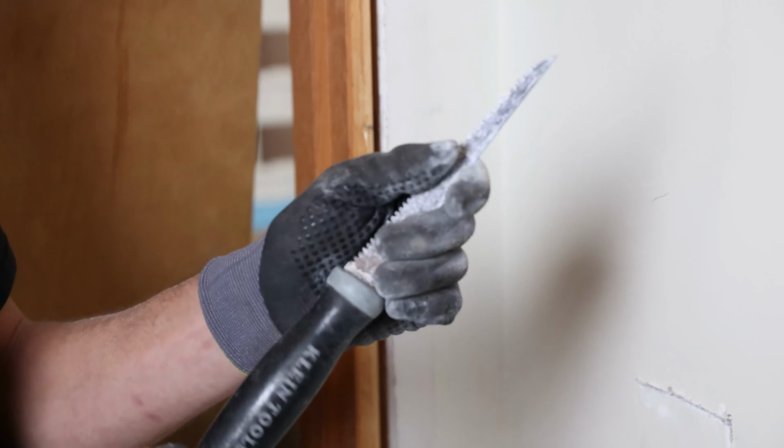I'm gonna label all these wires. I've got 4 of them. 3 of them are identical before I fish them down the wall. And I'm not quite ready to do that, but this is vanity lights. V-A-N, vanity. This one is hot. H-O-T, feeding from one box to the next, carrying my main hot, my main neutral. That's like the trunk line. And then this one, I'm just checking each one of them. Be methodical. I'm not good at methodical, but I need to be. This one is wafer. So when I fish them down the wall, I know exactly what they are. Keeping the labels, labeling the heck out of stuff.